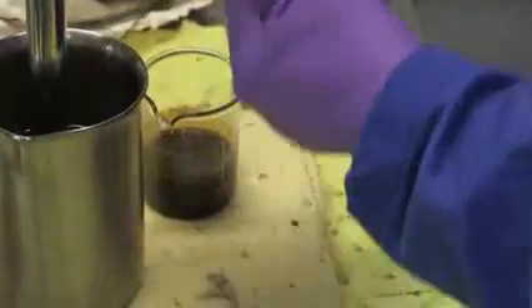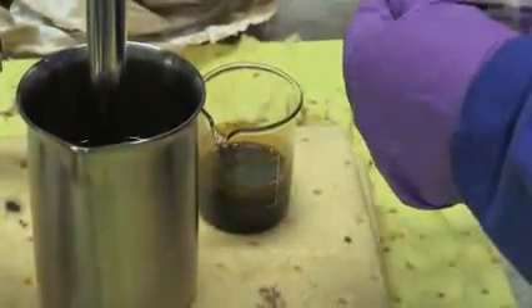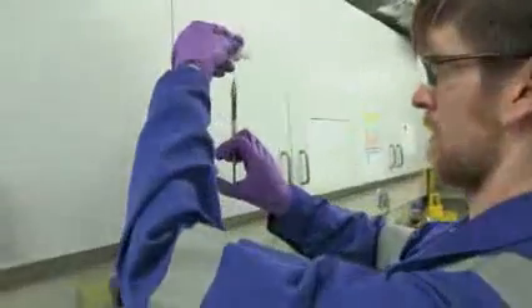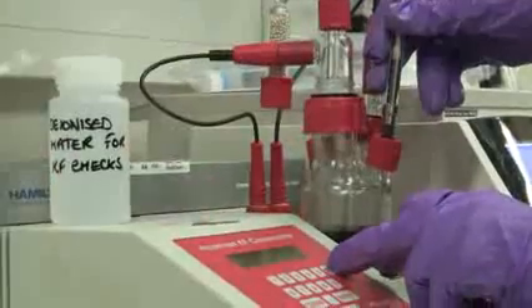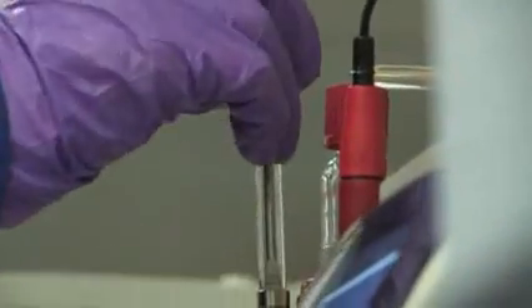The less water you've got, the more oil you've got. Therefore, the more money you're making basically. I'm going to bring that up to get rid of the air at the end of the syringe, take that up to 500 microlitres, make sure it's set to the right program, and then we just hit start and add our sample.